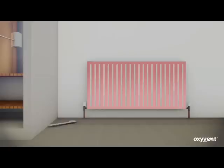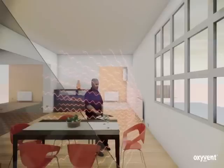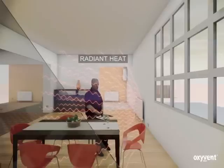The front panel of the radiator is heated at a much more even temperature. Therefore there is more powerful radiant heat emitted. This will reduce the power of the convection currents and increase the radiant heat transfer to the room.